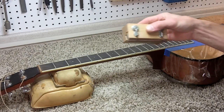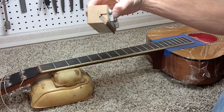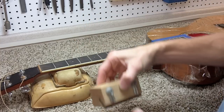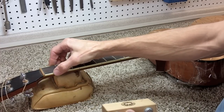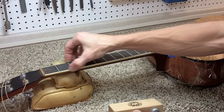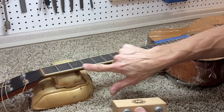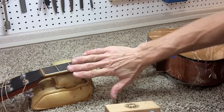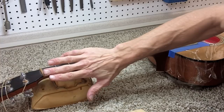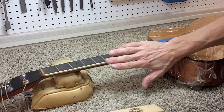The other tool is a file held in a block of wood at an angle — typically a 35-degree angle. This helps achieve the desired 35-degree or so angle on the ends of the frets. I also like to come slightly into the corner of the fingerboard. Rather than leave that edge sharp, I like to take the fret end bevel completely across all the frets and also slightly down into the binding or corner of the fingerboard.